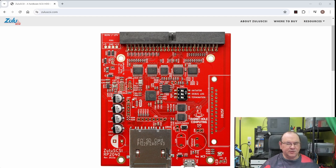And then very important to SCSI is the concept of termination. When you chain several devices, the last device has to have a termination. They talk about the termination being either active or passive. In those cases where you have a chain of devices with an active termination, and this emulation card would be used to replace one of the devices, I don't suggest that one relies on the card being powered through the termination power, even if it's supported by many of these cards. I just don't like that idea.